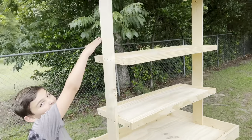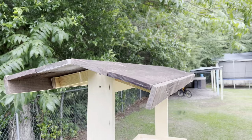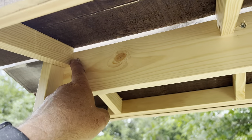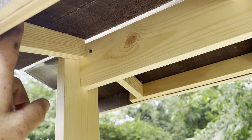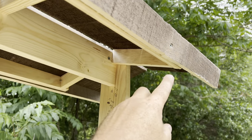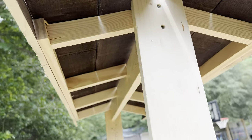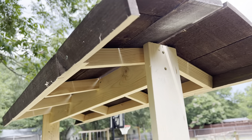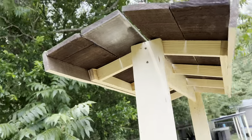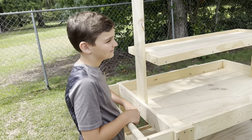Josiah's got a roof — just in case it rains! This is solely for looks. We're using old rustic leftover wood and just framed it up. We cut this on a 15 degree angle on one side, straight across with a normal cut, and then 15 degrees on the other side too. We ripped one and a half inches on the outer piece so nothing is exposed — it looks good and finished. Now we just need gutters!